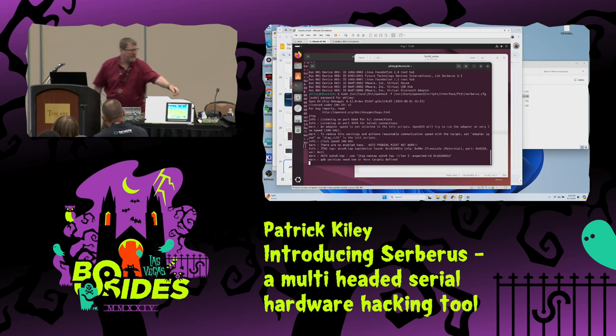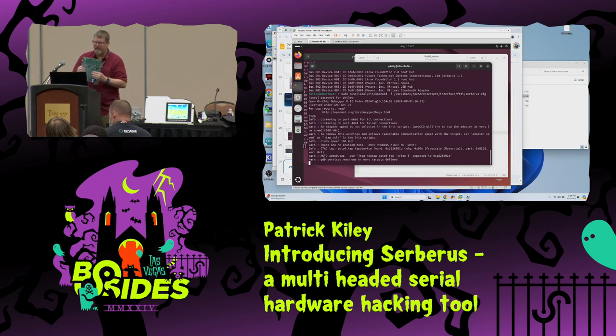What I'm actually connected to, if we get the camera to grab that in a second, to zoom in on this, is the outside pins of this connector right here. This is the JTAG connector for the vehicle's security gateway. For an automotive target, a security gateway is essentially the firewall of a car. And I have basically JTAG access to this. With JTAG, I can read, write, I can halt it, I can change the specification, I can do whatever I want to. The security gateway sits between the CAN buses of the vehicle and the infotainment system, the internet connection, everything else. So it's a very juicy target. That's the one that had the configuration file that I had to change when I did the ludicrous stuff that I talked about earlier.